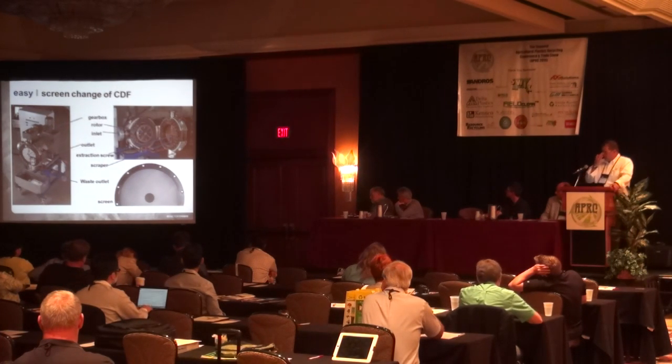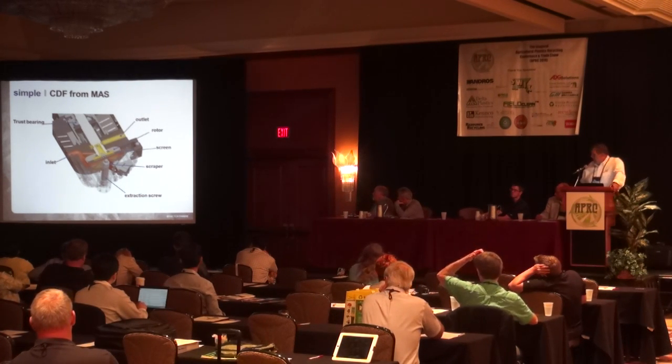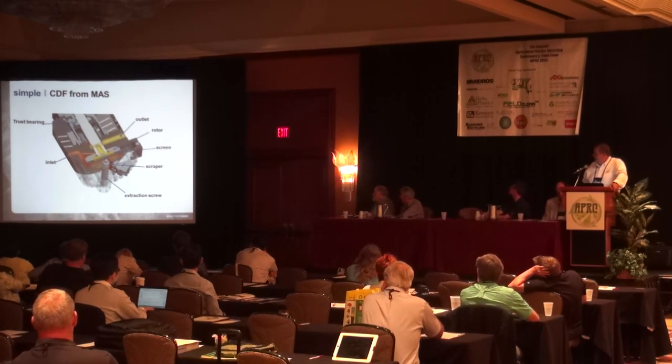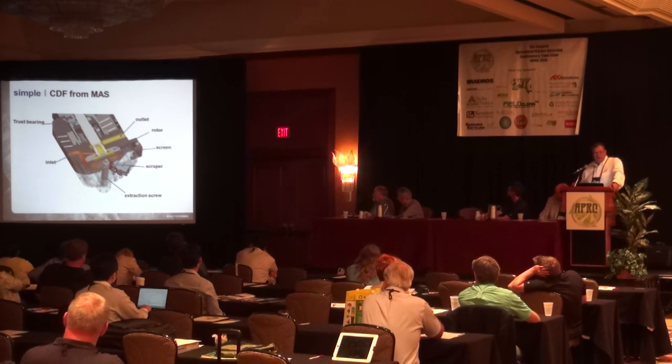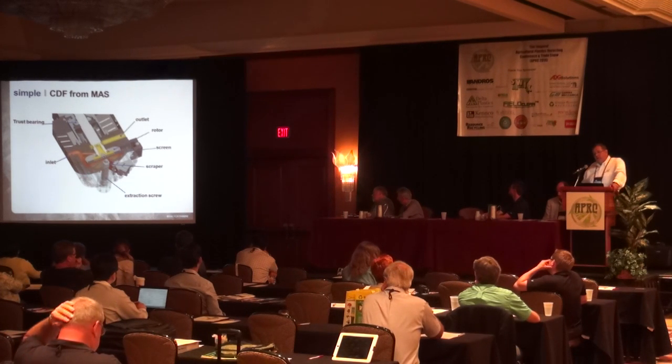The way this technology works is we have a steel plate that's perforated to the desired melt filtration. The melt is going in and is distributed over the screen, and this screen rotates. So any paper residuals, organic matter, will get caught by the screen, and it will be immediately lifted off the screen by a scraper, and that scraper puts it onto a discharge auger,